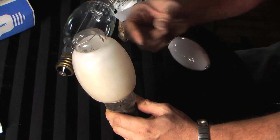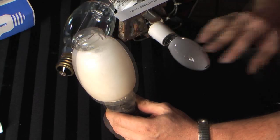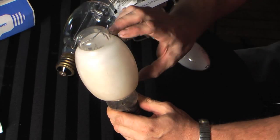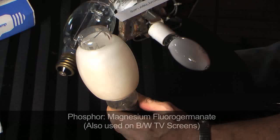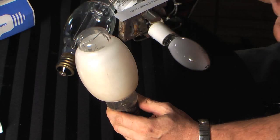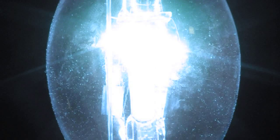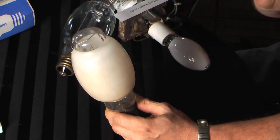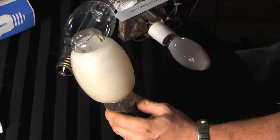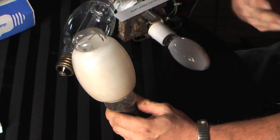This is a GE Bonus Line lamp, known as a C lamp or color-improved lamp. It's one of the earlier phosphor-coated mercury lamps and dates back to 1963. The phosphor coating on the inside of the bulb is similar to the coatings used on fluorescent lamps. Because the arc tube is made of quartz — which transmits ultraviolet light readily — the arc tube gives off quite a bit of UV radiation. The UV strikes the phosphor and makes it glow an orangish color. Add that to the blue glow of the mercury vapor and you get a lamp with a beautiful yellowish-white color and much better color rendering. Objects show their colors better, though it puts out a little less light than the clear lamp — what it loses in light output it gains in color quality.